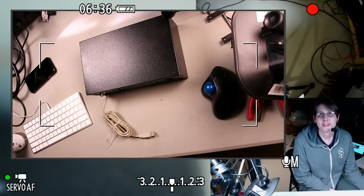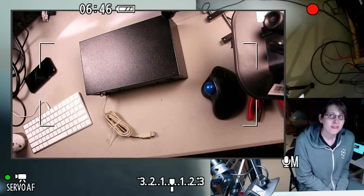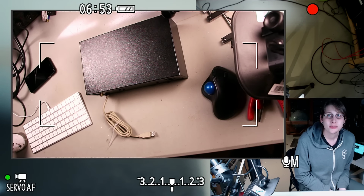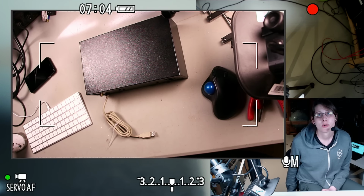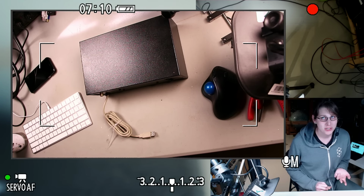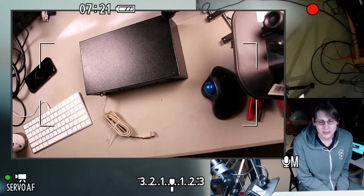Interrupt transfers have a really strict bandwidth limit, so if you're working with a device that has this low-speed USB limitation, it's not just the 1.5 megabit line rate that you're dealing with. The protocol will often limit your practical data rate to something more like 8 to 16 kilobytes a second, because at that point you're getting a constant stream of packets at a rate that's at the operating system's discretion, if you're lucky down to a millisecond. The bandwidth is that rate combined with the packet size that you're allowed by the hardware.